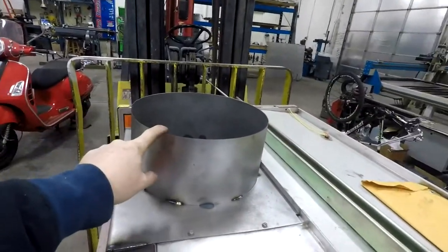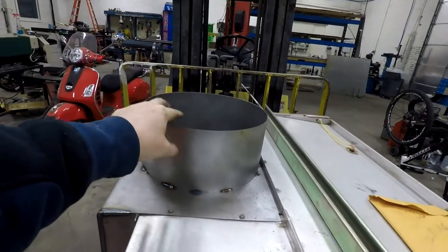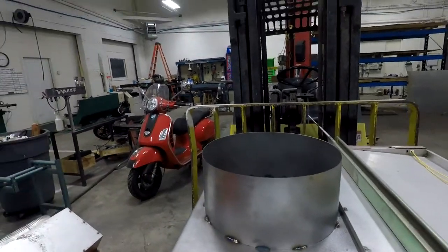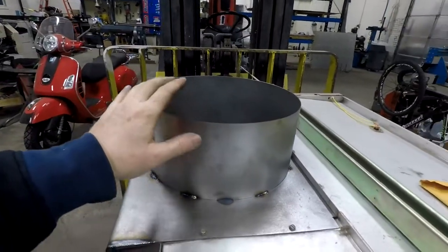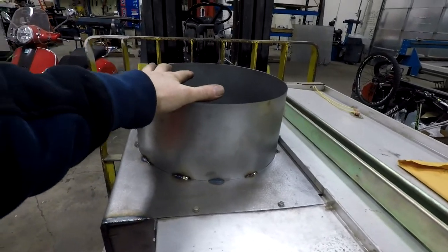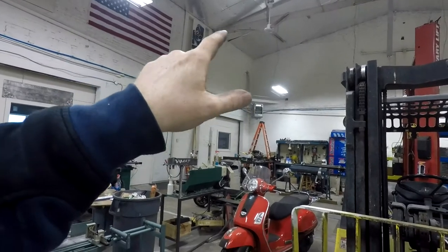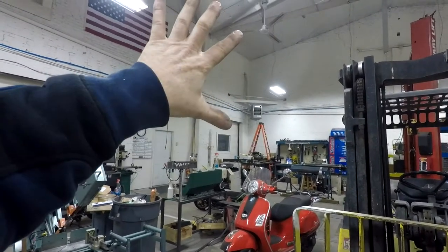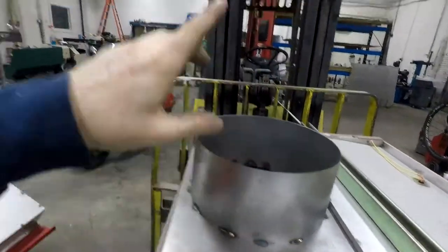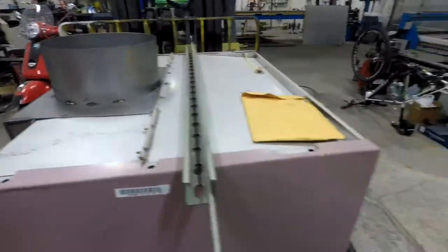A 12-inch pipe is actually 37.68 inches wide, so it's almost a full sheet. If you would run it 8 foot, that would be a full sheet of metal and also a pain in the butt to roll. So what I figured I would do is just run it straight up, straight out. I'm just going to knock out the brick there, make a base plate that goes around that and mounts to the wall, and then another port that goes straight through it. And then my exhaust will head straight out. That way I'm using the least amount of material.